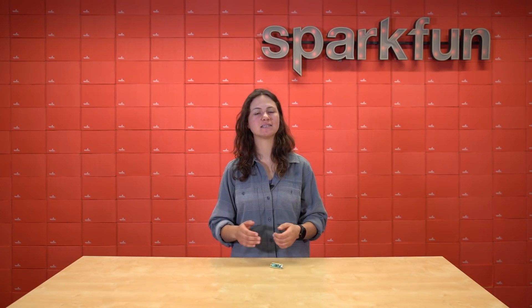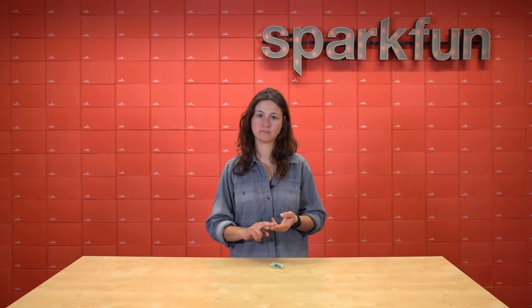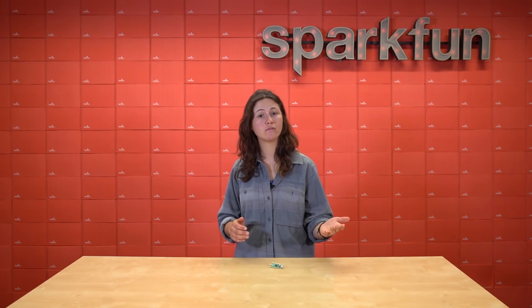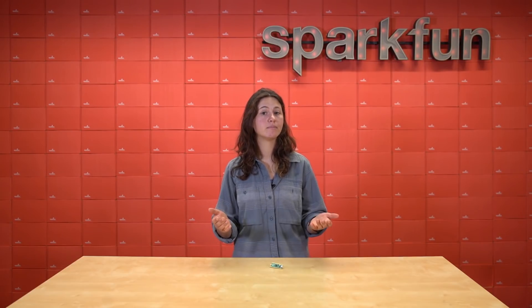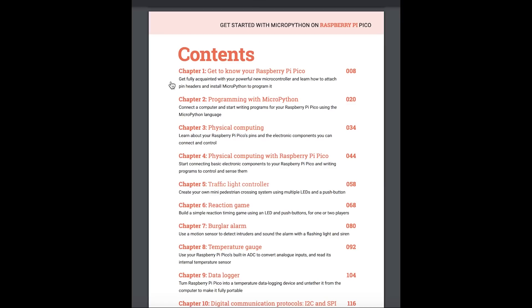The Raspberry Pi Foundation has continued their language support for Python with the RP2040 and the Pico because Python is extensible, modular, and flexible. However, Python is too resource-intensive for small microcontrollers, so the RP2040 and the Pico will use MicroPython, which has a subset of all the standard Python libraries so as to not use a lot of RAM — approximately 16K. But the semantics and syntax of MicroPython is the same as Python, so we're in luck. Plus, Raspberry Pi has a plethora of resources for MicroPython to get you started, including their book that's literally called 'Get Started with MicroPython on Raspberry Pi Pico.' It doesn't get much easier than that.